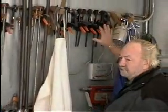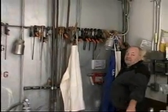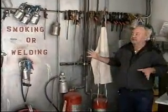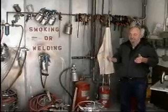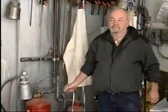You cannot spray in a spray booth without the air fans being turned on, because it has a control switch here. So years back, they used to play with the hoses and people used to get injured with it. So now they have it where once you turn the spray booth on, you'll receive the air. And also a lot of them wouldn't turn the spray booth on and spray without the booth taking the fumes out into the filters. So the whole shop would be full of contaminants. And then if you look up above, over on the top here, we have 2 air exchangers. There's an air exchanger down here, and there's an air exchanger at the front of the shop. We do this with a cross ventilation with the booth, so we can kind of keep the fumes down in the shop.